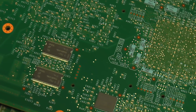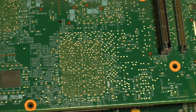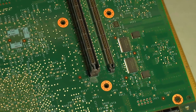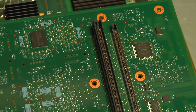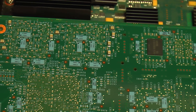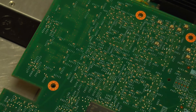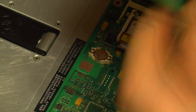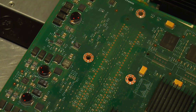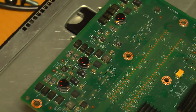The other card plugged into the motherboard is the policy feature card or PFC. If you want to know what role the MSFC and the PFC cards play in the switch, there's a link in the video description straight to the Cisco website where they cover all these cards. There's not much else to see on the bottom — just an Altera Max and a bit of RAM. But if you thought that was featureless, wait till you see the top side, because most of it is under heatsinks. And because we've effectively sold this switch, I can't pull them off to see what's underneath.